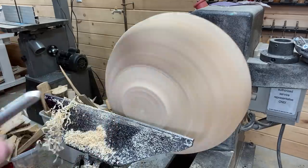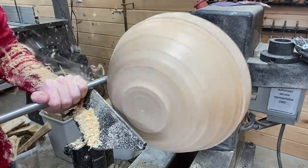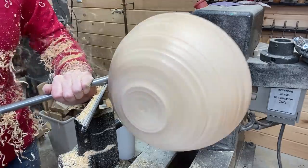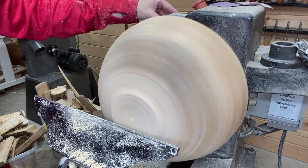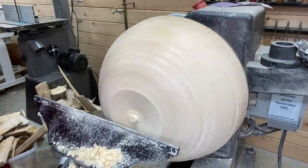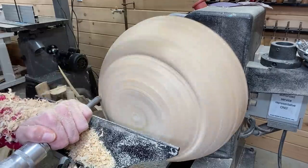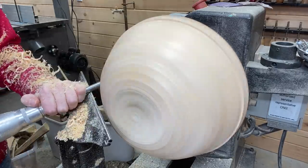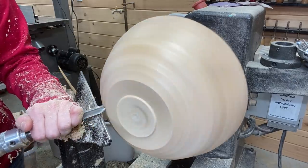Flattening the bottom and then taking some push cuts around the side. I really need to invest in the robust exterior curved tool rest — this would make this much easier instead of stopping and moving it. Stopping and moving it is much better than overextending the bowl gouge and getting hurt. Here I'm deciding that I am going to use a tenon, and I'm flattening a part of the bottom so I can do that. The cuts at this point still aren't really clean cuts — they're better but they're not perfect, and I don't worry about that too much until I get the bowl reverse mounted, and then I can clean it up a little bit.